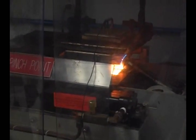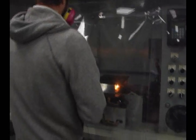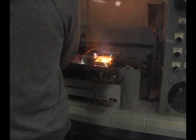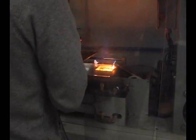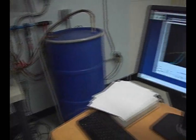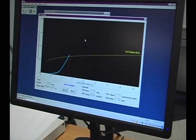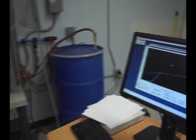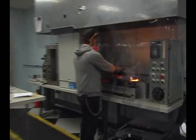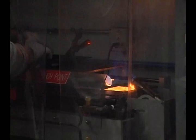Aaron, our test technician, takes a swatch of the fabric. In this case today he's testing flame resistant socks. He'll take a swatch of material representative of the product being tested for certification and place it on the holder in the fixture. It's clamped down to hold it in place. There's a sensor he places on top of the sample, and when he begins the test, the sample with the sensor is slid over the thermal load.